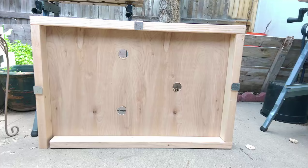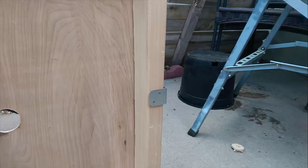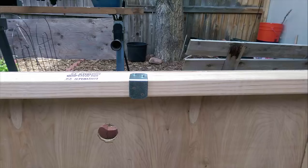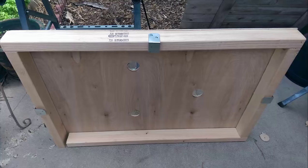What you're seeing here is the back of the lamp coming through each one of those holes — the hole is just big enough for the base of the lamp to feed through but snug enough that the lamp doesn't fall out. At this point we have also attached the little L-brackets. You're going to attach those to three sides, and then the back panel will just slide in and out of those little brackets. When you install these brackets, leave just a little bit of space for your board to fit in so it's nice and snug, depending on the thickness of the plywood you're using.